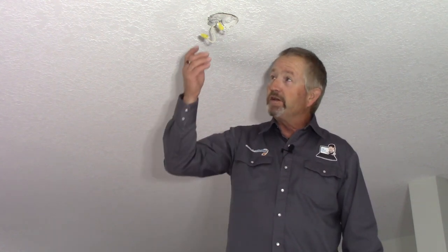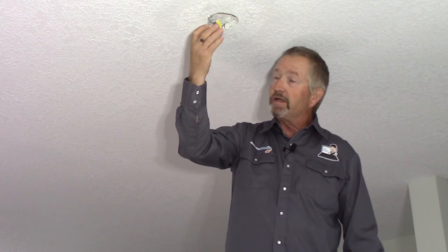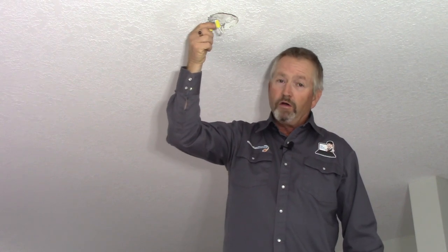Well hello again do-it-yourselfers, Terry Peterman the internet electrician. Welcome to another one of my video shorts on current topics at electrical-online.com and right here on YouTube. In this project I'm going to install another ceiling fan with a remote control. It's a good fit for this location because I only have two wires — a hot and a neutral — coming to this, operated by a control switch. The remote is good if you want to have both light and fan operation. It's right in front of the fireplace here in the living room, so a fan was essential, and a light kit with it as well, as long as we have a nice low profile one, because the ceilings are only eight feet high. I've done a couple of ceiling fan videos before — in fact, installing a ceiling fan with a remote is one of my most viewed videos on YouTube.